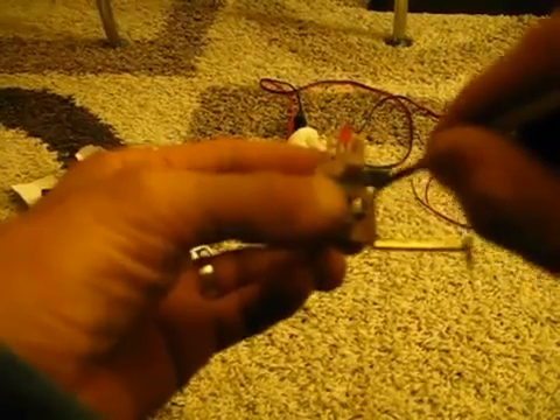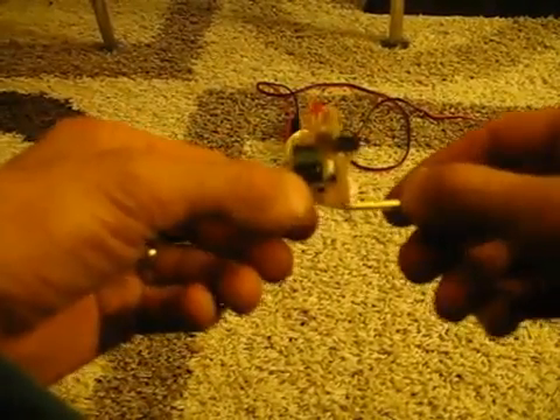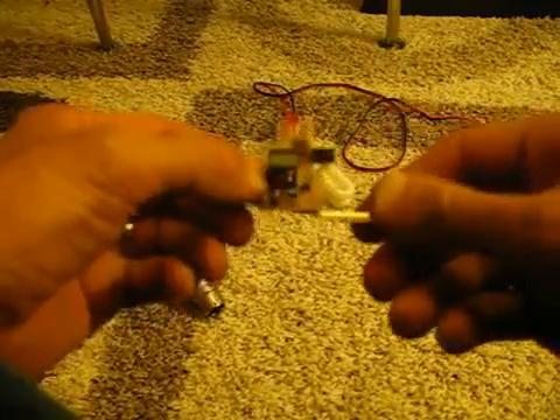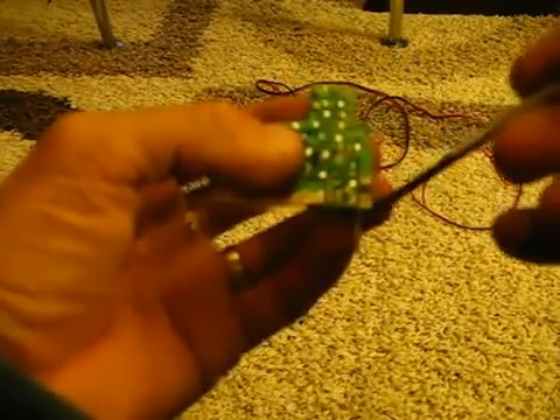Now push the little red light to the side there just to keep it out of the way. Some people recommend removing a little transistor here — it's normally marked 0.4 or 0.5 and it's the one opposite the slot hole. This is the transformer, this is the part that does most of the work in this experiment. Now all you need to do is, if you look on the back, there's two pins where the charge switch was. You can bridge those two pins or you can fit a switch between them.